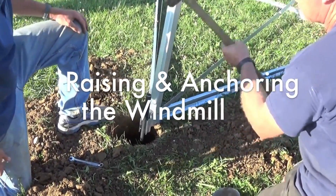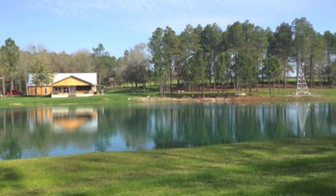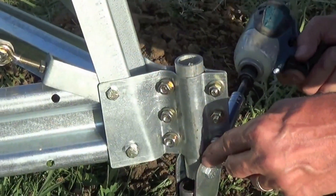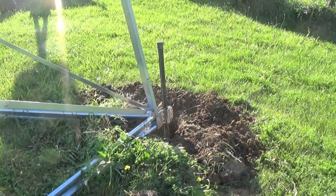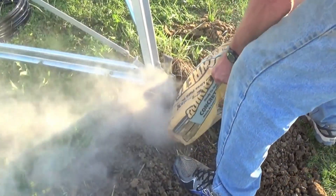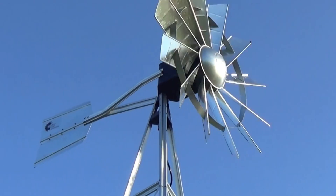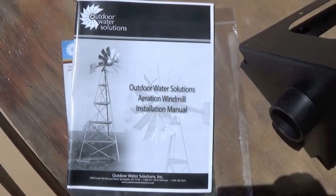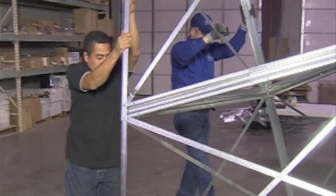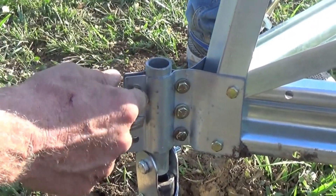Raising and anchoring the windmill. Outdoor Water Solutions will not determine the soil and wind conditions for any windmill installation — these conditions must be determined by the customer. Anchoring of the windmill is very important and it is the customer's responsibility to adequately anchor the tower. We provide a basic anchoring kit and strongly recommend the use of concrete pilings, a concrete pad, or screw-in anchors. High winds, wet or light soil conditions can cause the windmill to fall over, physically damaging the rotor head and other components. The warranty does not cover any kind of wind or weather damage. It is best to have three or four people to help raise the completed windmill. Use a third person to anchor the base of the tower to prevent it from sliding, or better yet use our hinge kit.